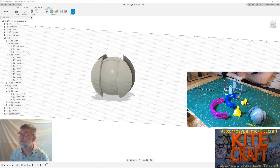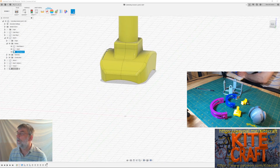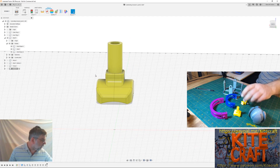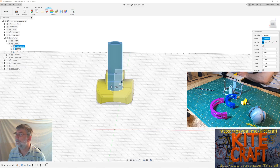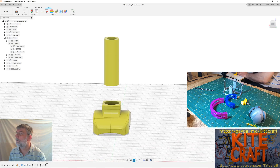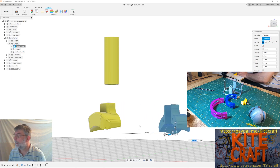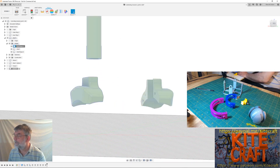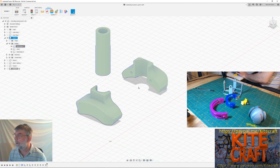It's the same on these upper and lower shafts — they're made in several different parts. The upper yellow bit that we see here is actually made in three parts: the shaft itself, which is just a tube, and then we have parts A and B. These can be printed with this surface down and you don't need any supports — they'll just print with this side down. Again, some aligning pins help you glue it all together, and once these two pieces are glued together, you can glue the shaft into this hole.